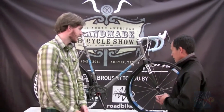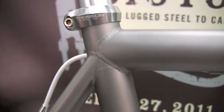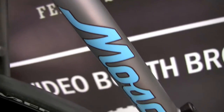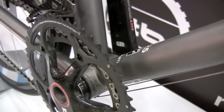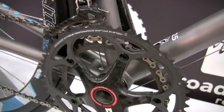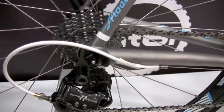I'm also doing a lot of steel right now as well. Across the board — mountain and road, lots of cyclocross, custom projects. This is the Institute model from Mosaic Cycles. It is a custom-butted, size-specific titanium tube set, 3/2.5 titanium, custom-butted per rider weight and size. This one is my own personal bike — I've ridden it a ton. It's a 59cm and comes in at about 16 pounds. It's got the BB30 that I've been testing out all summer long, and I really like it in titanium.